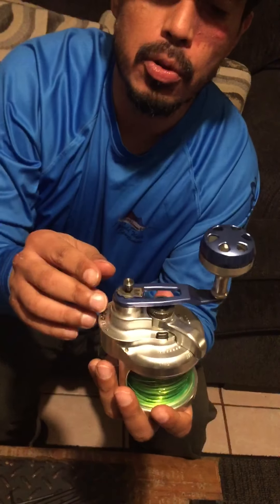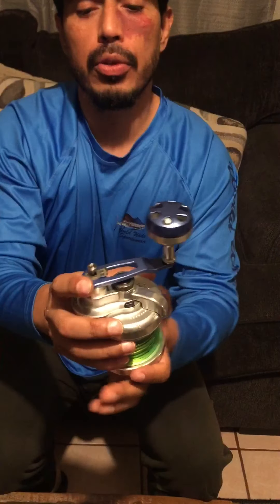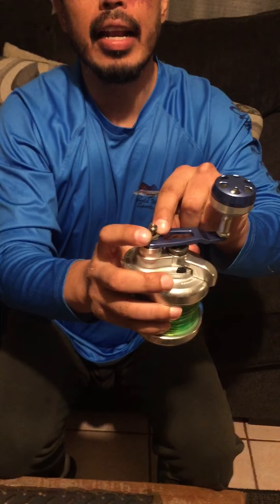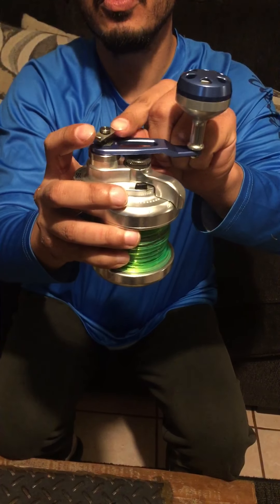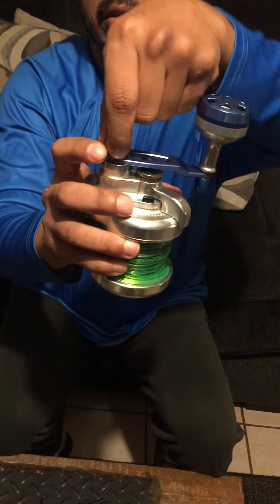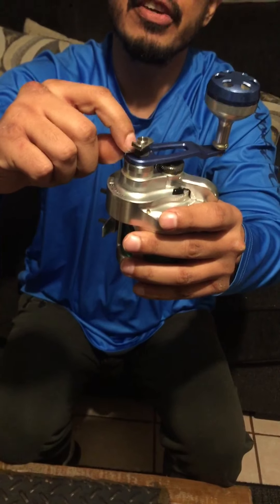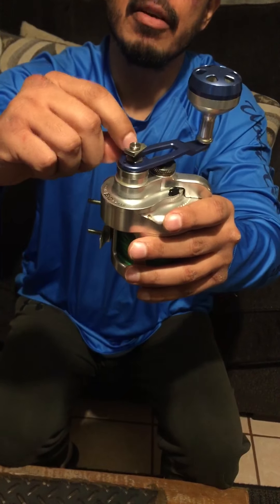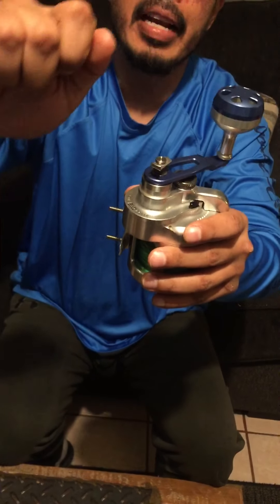It has to be really smooth. What you can do is slide this piece and you'll realize it gets stuck as you're sliding it. Pick it back up, use your nail right where you felt it got stuck and you'll feel there's a burr — a slight piece of metal that came up from torquing it too tight, or perhaps the wrench slipped on you.